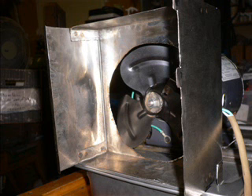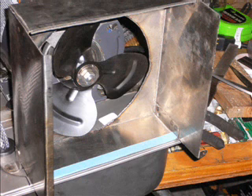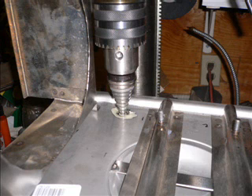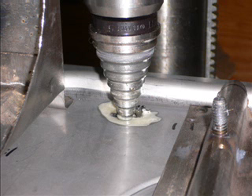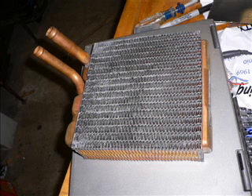Continuing on, we've got temporary wiring going in here. I wanted to see how much air was actually going to blow back onto the motor for cooling. That blue stuff is some weather stripping that I put in the box to cushion the heater core and make sure that it didn't get abraded. Here's a unibit — I'm drilling one-inch holes for the return water. It's unpressurized going in there so it just needs to drip down a tube. These are the reinforcing strips used to make the motor mounts on the top because I didn't trust the top not to flex.